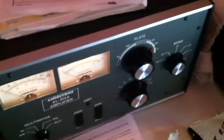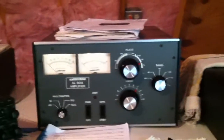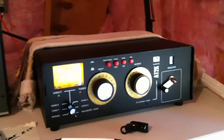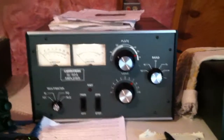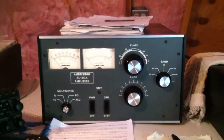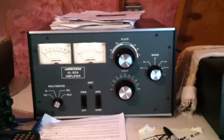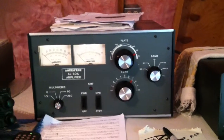Getting this together is crazy to say the least. Today's fun was that I put the 1-to-1 current balun tied in with the PAL-STAR and got it to tune on 160 through 6 meters, which I was pretty pleased with. The other thing I found out last week when I was attempting to do this was that on anything below 20 meters — 17 meters, 15 meters, 12, and 10 — I was getting a huge amount of RF.